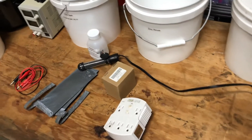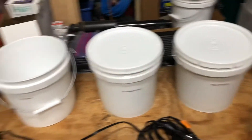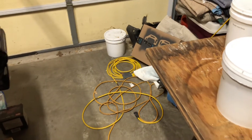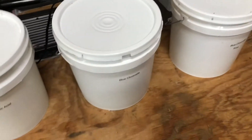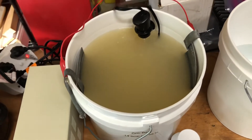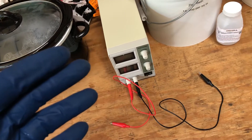Those are really the only parts I need to do. I'm about 15-20 minutes in, so I'll get my heaters going and get my crock pot going, then go do some work and come back out in a couple of hours when it's ready. It should only take 20 minutes to run an item through the process. I'll go ahead and drop the parts into the muriatic acid now — it'll be ready in a couple hours. So this is all set up with the heater, fish tank pump, zinc, and the two plates connected and ready to go.